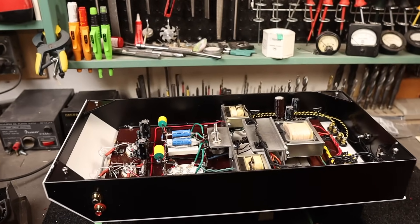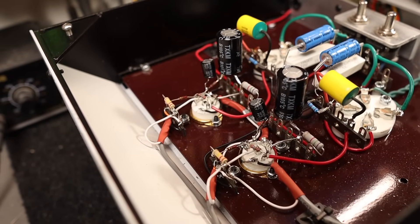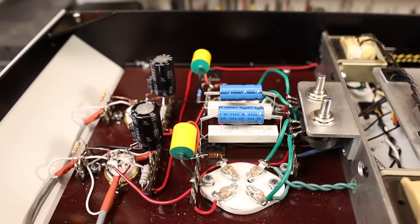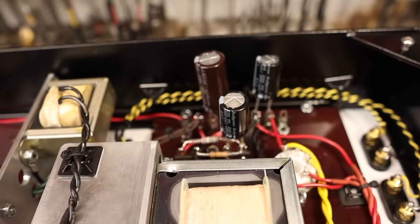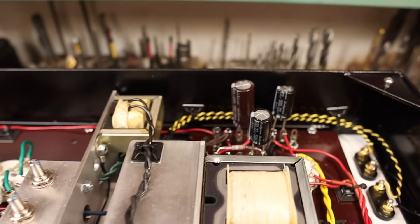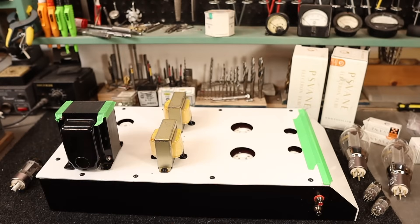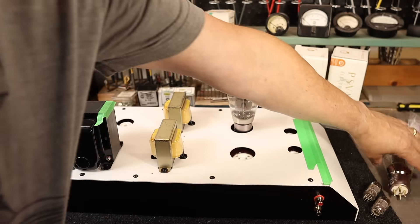With the rest of the components installed — grid resistors, cathode resistors, bypass caps, separate filter supply caps for the input tubes, high-quality re-caps for the coupling caps, bias resistors, power supply section components, and the voltage divider network for the 6.3V heater winding — we're ready to insert tubes. I'm not going to install the rectifier tube yet because I don't want to apply any B+ to the circuit until I've validated that the filament voltages on the other tubes are working. On the 2A3s the bigger prongs are the filaments — make sure they go into the bigger holes and don't force them, otherwise you'll ruin the tubes.